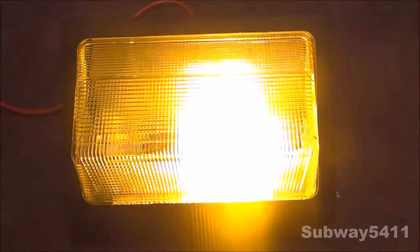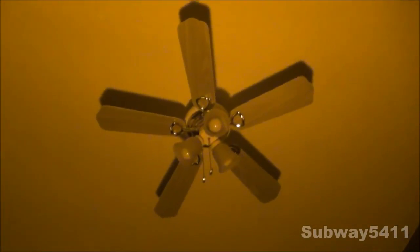Here's the lamp at full brightness - it's not too bright, but it's reasonable for an indoor accent light, which I'm probably going to use this lamp for. I really like low pressure sodium lamps. I like the colors that they give off and how efficient they are. Another thing I like is that they'll do a hot restart instantly - if I turn this off and turn it back on, there's no delay time. The camera picks up low pressure sodium lamps as being a lot brighter than they actually are in real life.